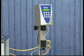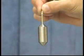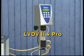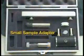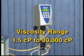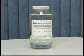Select a viscosity standard fluid based on the torque range and model of your instrument, the adapter chamber, the spindle, and the rotational speeds that you will be using. For example, an LV Torque Range DV2 Plus Pro viscometer using a small sample adapter with 13R chamber and SC4-18 spindle has a viscosity range of 1.5 centipoise to 30,000 centipoise, depending on the speeds being used. You do not need to select a fluid based on the material you will be testing.